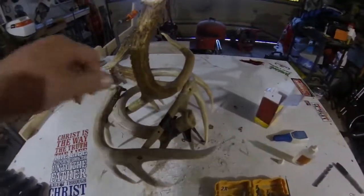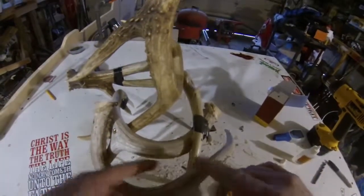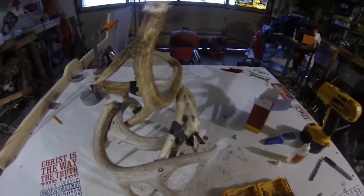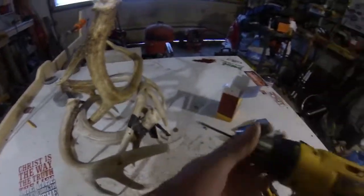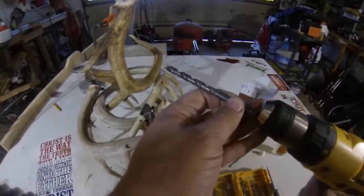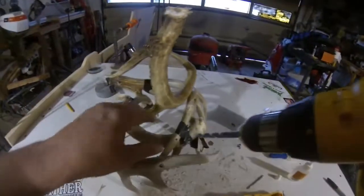If you drill all the way through, that's not a big deal, as you can see here, probably, on this one. We went all the way through. That's not a big deal. We're going to address that in a little bit. So we got the pilot. Now we countersink. We'll let the screw head recess in a little bit.